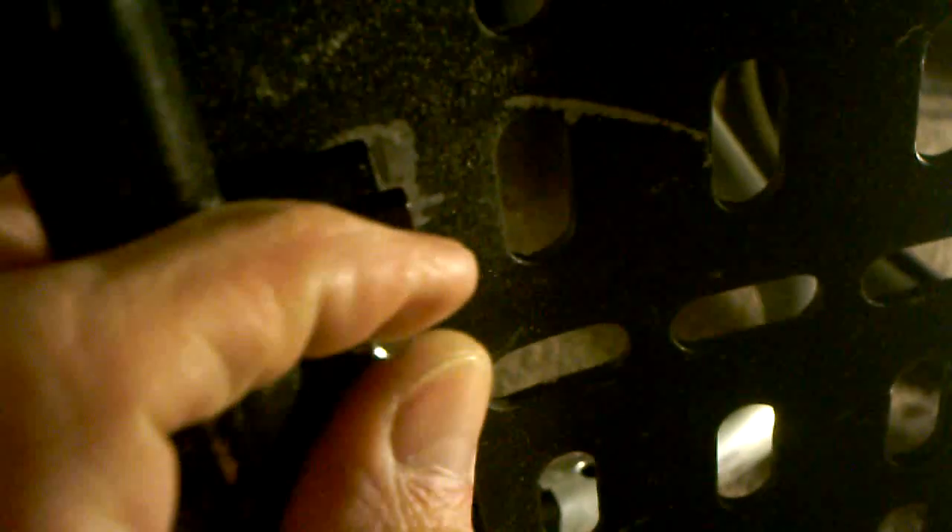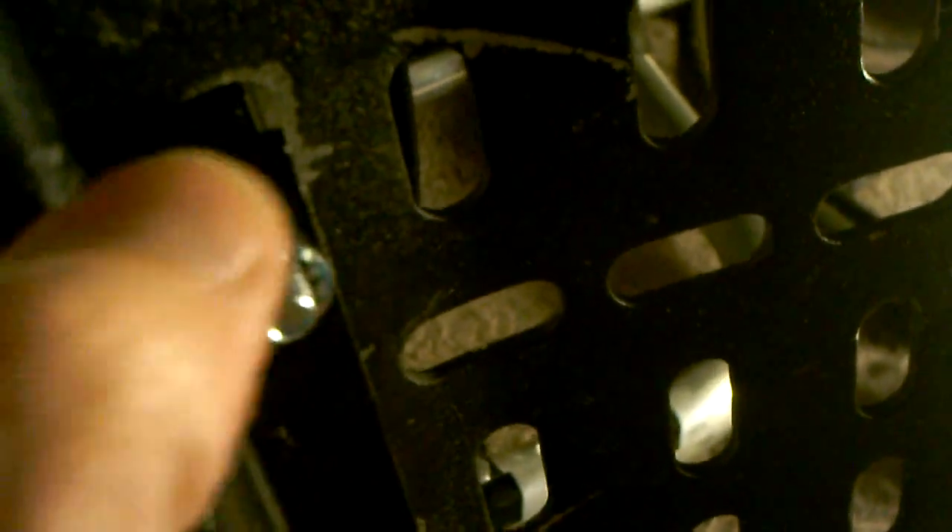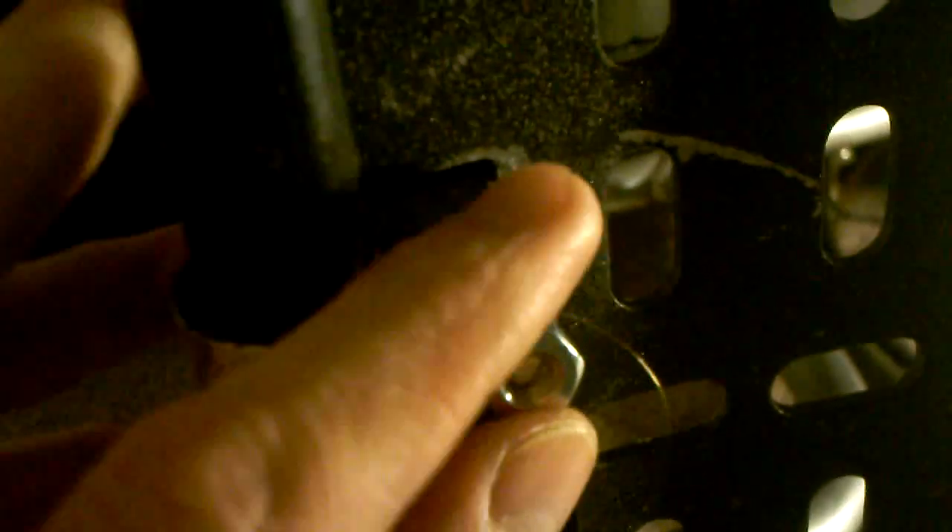On the other one, I put the bolt through and on top of the bolt I'm putting the lock washer. I want the teeth of the lock washer to point outwards — towards the nut — so whenever I screw the nut on, it pushes into the teeth of the lock washer.